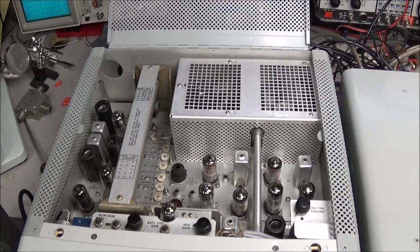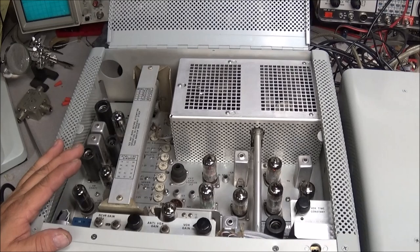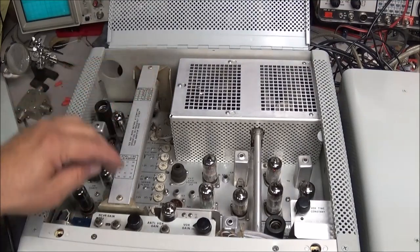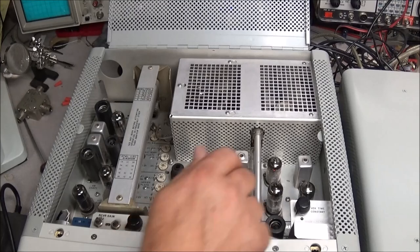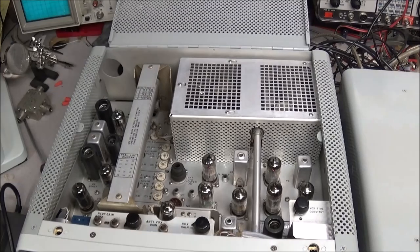Here's an inside shot for you Collins lovers like myself. You can see just how clean and nice this radio looks inside. Basically what we do is go in, pull out all the tubes, clean the sockets and pins, make sure all your nuts and bolts are tight, make sure none are loose or about to fall out, check wiring, make sure nothing is rubbing too hard on stuff. We check out a bunch of resistors and capacitors, and everything is looking wonderful. Greg will be very happy with this rig. We'll see how it develops down the road — if any little minor things come up, we'll address them then.